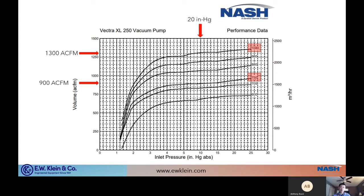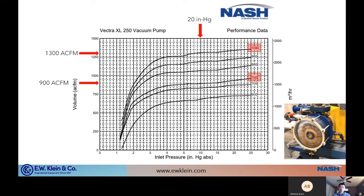But there is a limitation to all this. Remember at the low RPM demo pump — it was turbulent as it started up. It's the same thing here. If the pump doesn't spin fast enough, these pump curves only go down to 600 RPM. Anything below that pump speed, it's likely the pump is not spinning fast enough to create that stable liquid ring to actually pull any vacuum.